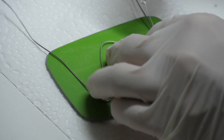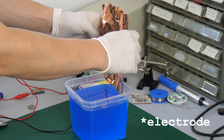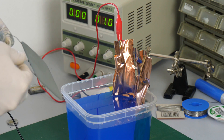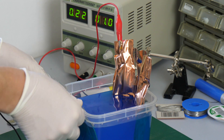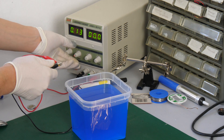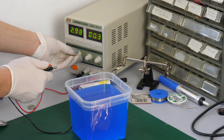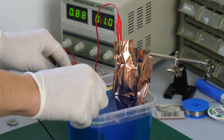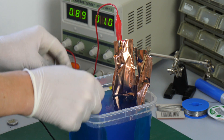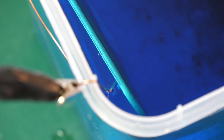Before coating the play button with zinc spray I added a piece of wire to the back so I can connect the part to my bench power supply. I used a sheet of copper as an anode in the bath, connected to the positive pole of my bench power supply, and the part gets connected to the negative side. It's very important to set the voltage and current properly — for copper plating you typically use 2-5A of current per square decimeter of surface to plate, which should result in a voltage of less than 2V. Make sure the voltage does not get too high because if hydrogen bubbles form on your part it will ruin the surface finish. A thin coat of copper forms quite quickly — just move your part from time to time to get rid of any bubbles. The longer you keep it in the electrolyte the thicker the copper layer will become. I left it in the blue solution for roughly an hour, which gave me a coating I thought was thick enough for polishing.